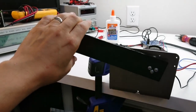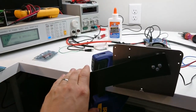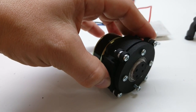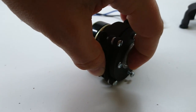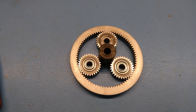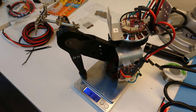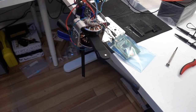With the controller in hand, the next step was to develop an actuator which had an adequate compromise between mass, torque, speed, and compliance. I started trying to build a mostly 3D printed inline planetary gear train based on 3508 motors. Then tried to use a pure direct drive with some 60mm and some 81mm diameter motors.